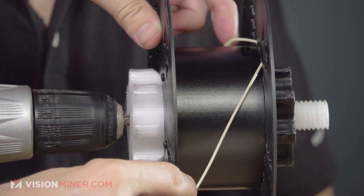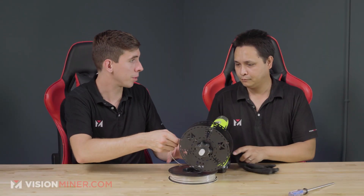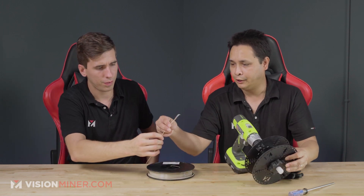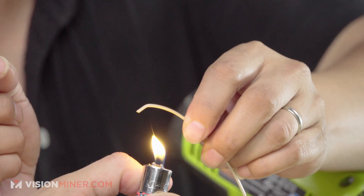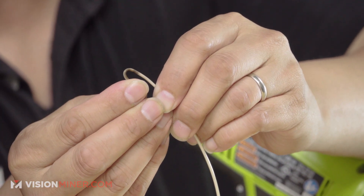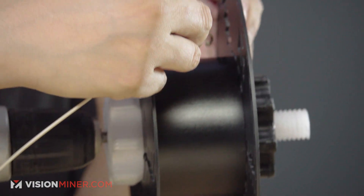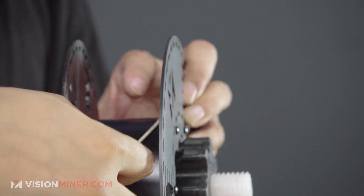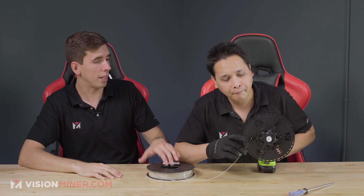But there's another way to do it that doesn't leave a little dangler. That's Jay's favorite method — you use a torch to bend just the end of the filament to make a little hook. Just heat it up a little bit to make it soft, bend it, let it cool down. Then shove it into this little hole so it won't come off. We designed the center hole with a slot like your standard spools, so you can just slot it down in and then it comes out of the spool and spools up really nicely.